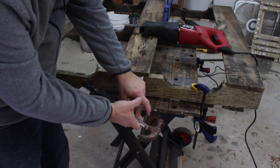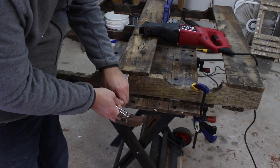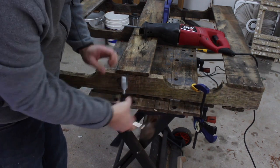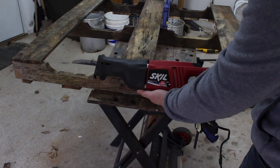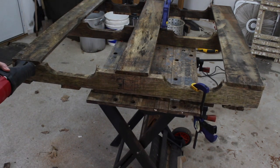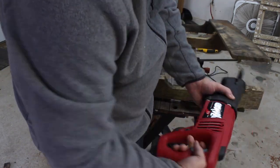What you see me doing here is just using a simple chisel to pry up the boards just a fraction of an inch, so it's going to give me a little room to get my saw blade in. I'm going to be using something called a sawzall, which is like a heavy duty jigsaw. I'm going to be using a blade that is specially made for metal, so it can go through these nails pretty easily. After you've sawed through these nails, you can actually leave the nails in place, or some people will also take a punch and punch the nails out.